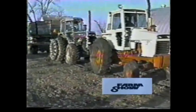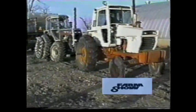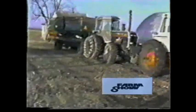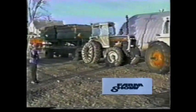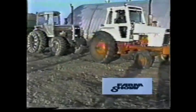So now we've got quite a few thousand pounds with an extra set of tires pulling. As the camera goes around, you'll notice the tractor in front has a posi-lock, and you can see underneath that both tires are pulling. Also on the White, posi-lock is locked in for the rear tires, but the front differential does not have posi-lock. And now we're engaging the dynamite.